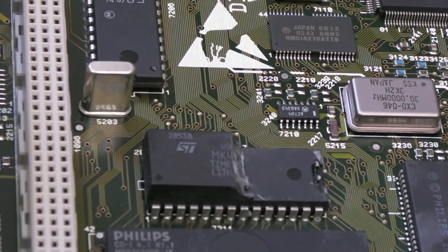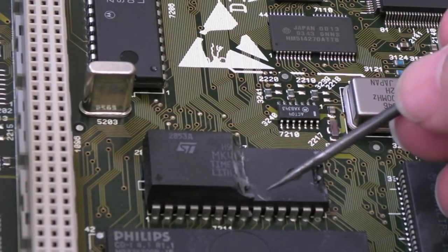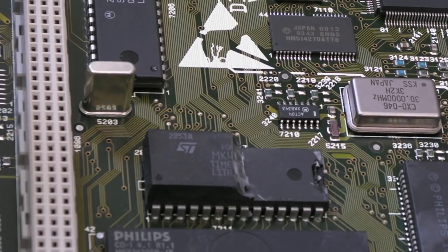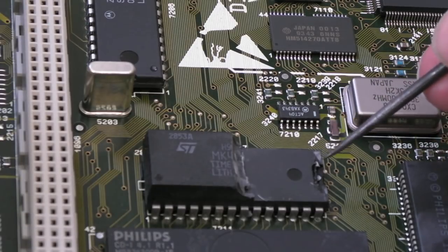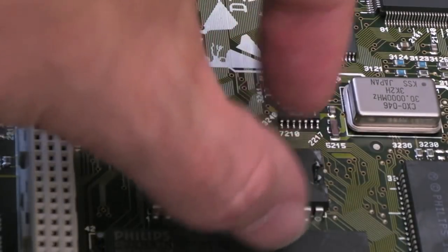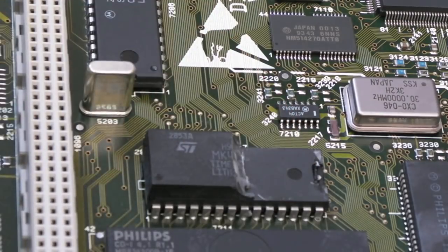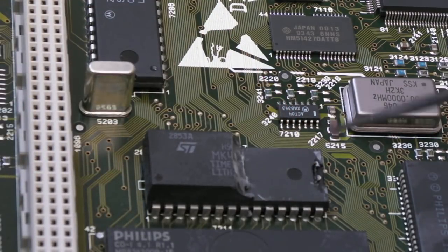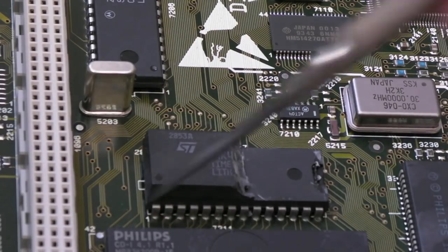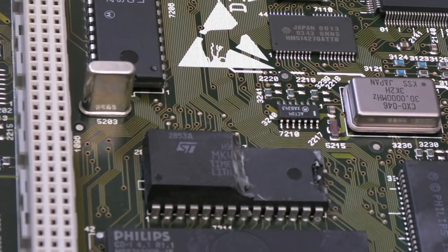Looking pretty good there. I just need to clean around — I'll perhaps use the fiberglass brush, just on these connections here. See if I can clean them up a bit. We'll get a CR2032 battery holder on there. I'll perhaps use some hot glue to hold it down, but the connections will hold it in place as well. What we can do is test for continuity on the meter — because one of these is going to be ground. If I find the common ground on the board, one of them should have a ground connection there. I was just testing the ground from here. The bottom pin there is a dead short — the top one isn't. So the bottom pin is the ground.